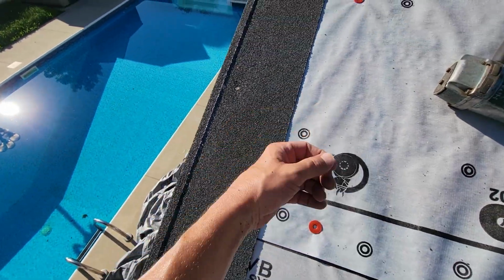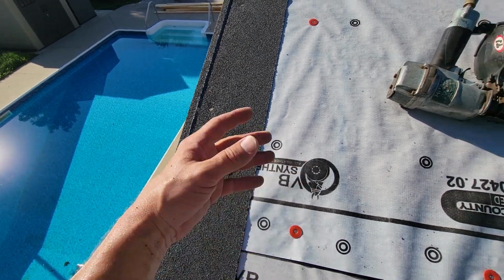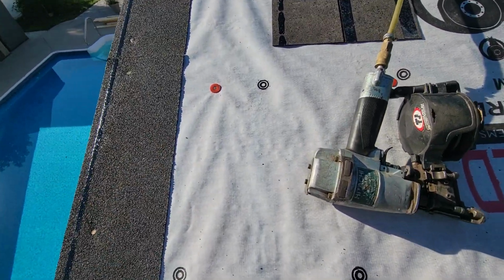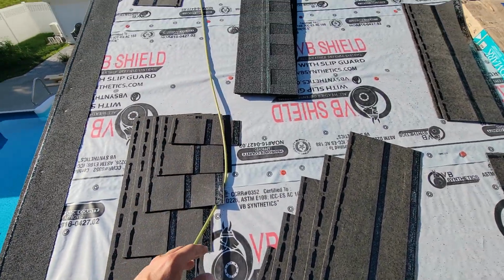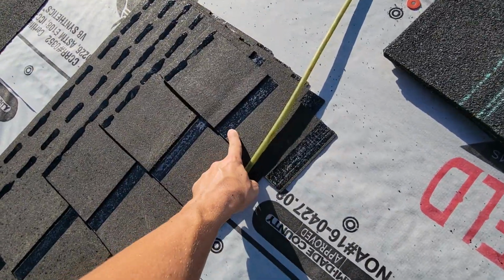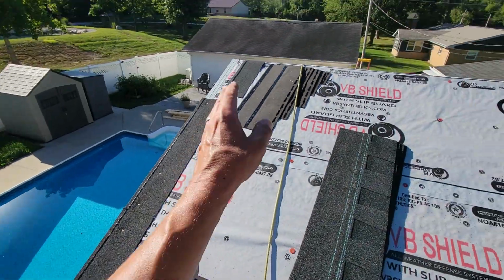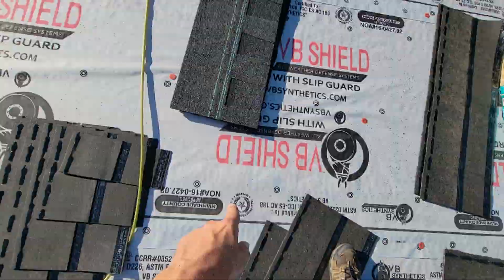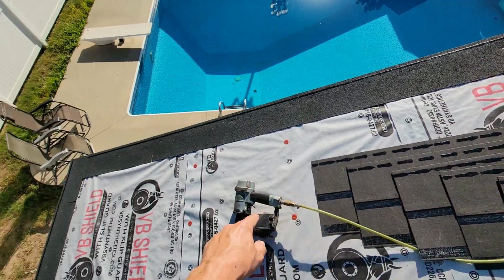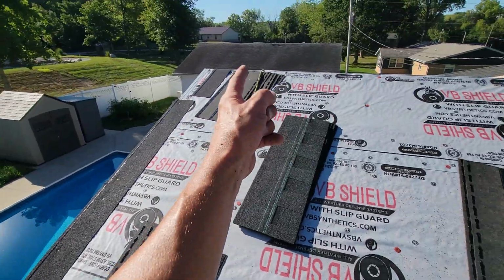But instead of starting to roof this and you got to reach down here and cut it, whether you're right-handed or left-handed, it doesn't matter. You still got to set your gun down, switch, and fiddle around. It's really simple and easy. With this method, by the way, you cut enough coming down here with about a 5 to 6 inch stagger offset on these. It's about the same of an exposure. So if your cuts stack, like this stack here is right under that one, this one, I got one more to cut, you don't have to stop.